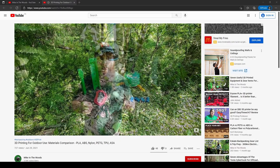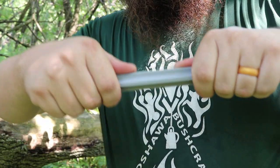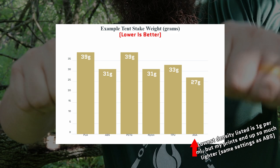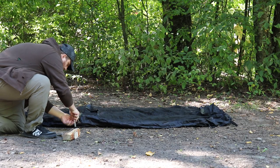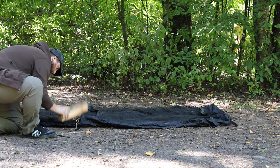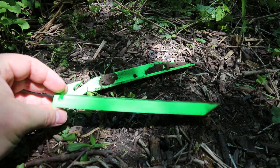As I mentioned in my 3D print materials video, the material that the tent stakes are printed in matters a lot. For my initial set of pegs, I printed them in ASA, which is a strong, durable plastic meant for outdoors use due to its resistance to UV and water degradation. The added benefit is that they were the lightest of all the test pegs I printed in different materials, at only 27 grams per peg. The goal isn't necessarily to beat metal — it's to see if it's good enough for something that can cheaply and quickly be made at home, as needed, and be completely customizable in length, girth, material, color, and what type of ground it's going to be used for.